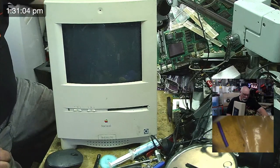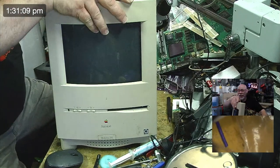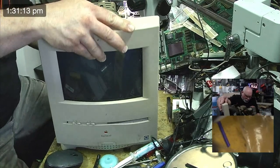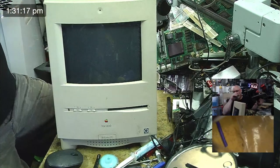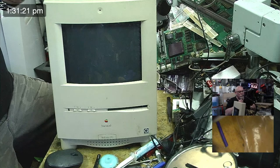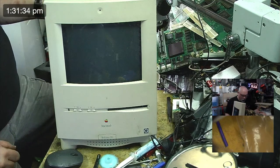It's in full voice. So, I have now replaced, there are eight chips there, and I believe I've replaced five. So I've got three left. And then of course, if it still doesn't work, then we've got to start looking elsewhere, looking at the schematic and finding out other chips that might have something to do with the RAM. I suspect U22 might be one of them, or maybe U10 or U11, but I won't know without looking at a schematic.